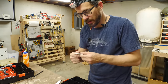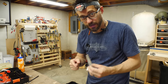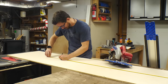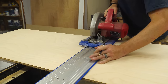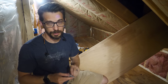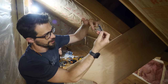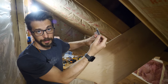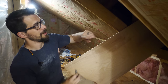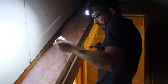I was digging through trying to find some screws — some that are not going to be too long and poke through the door piece, and some really long ones to go into the 2x6s on the side. I cut down a piece of half-inch plywood for the door, but if humidity affects it at all, I'll replace it with pressure-treated wood. Basically we're going to take this hinge — this side of it is going to go onto the 2x6 rafter, and the long side is going to go on the backside of our plywood door. So I'm going to screw that up in there with the hinges so the door opens outward, and then we're going to lay some insulation on the backside of that door.